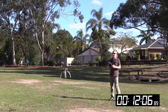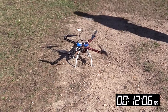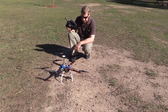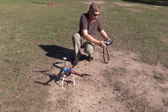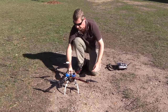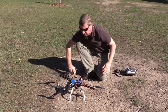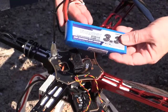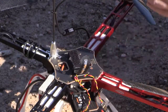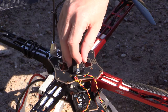We've just seen the red LED and it's come down from an autoland. Let's shut it down. Quite happy about that — it exceeded the E-Calc suggestion. And these Gemfan propellers obviously work, so I actually got to try two different things today. Well, that was the Turnigy battery. I'll actually repeat this hover test using the yellow Zippy battery — it'd be interesting just to do a comparison.